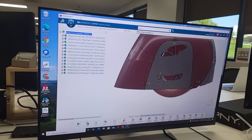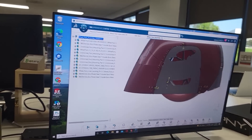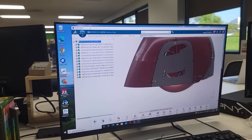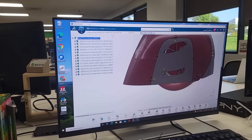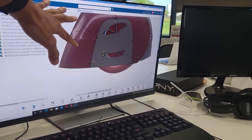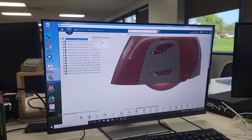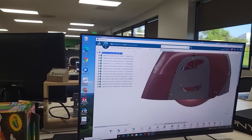I expect the wheel pan will have a composite material of a very high stiffness-to-weight ratio, because it experiences accelerations substantially above that of the body. The suspension works such that the acceleration of the body is much less than the acceleration of the wheel going over a bump — and the wheel pan is effectively fixed to the wheel, so it'll have the same acceleration. It also needs to be relatively inexpensive to replace. That brings up the concept of ethylene vinyl acetate.